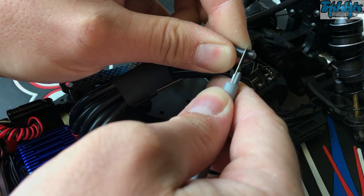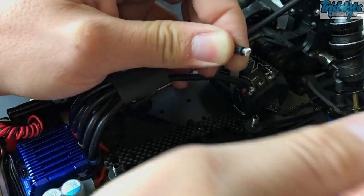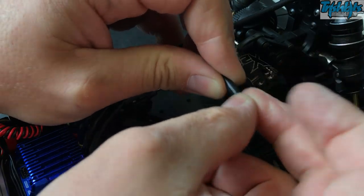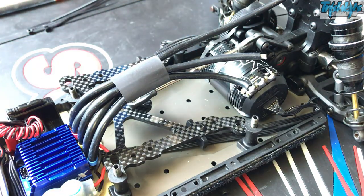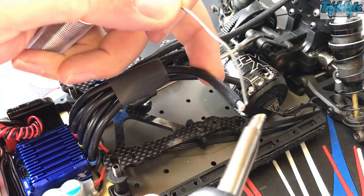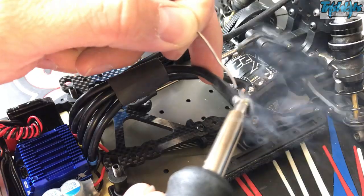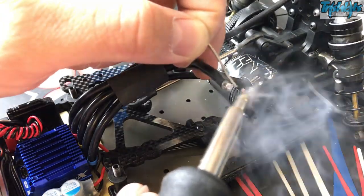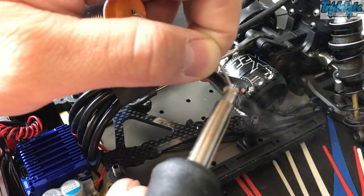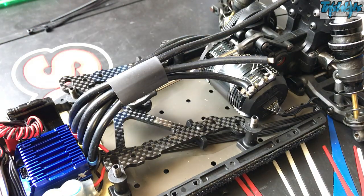I'm going to take about 4mm off. Just gently touching it — picked it off nice and easy. Make it round, give it a twist. Then all we do is get our solder, put a little bit on the iron first to connect, and then go straight onto the wire and flow it over. Sometimes you end up with a bit of extra on the soldering iron but not on the wire, and you carry it away on the soldering iron and put it to the side.